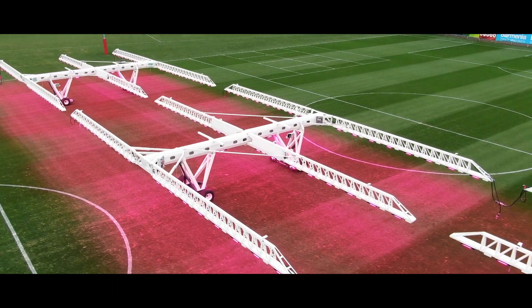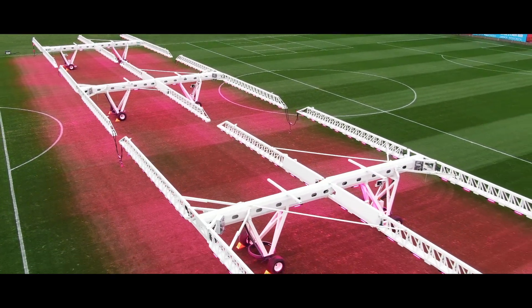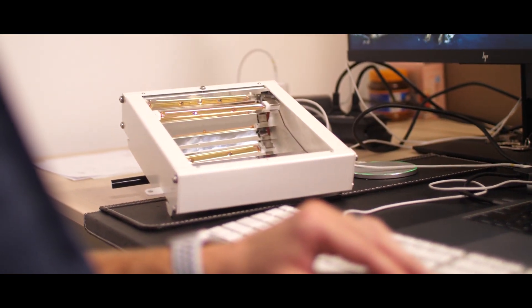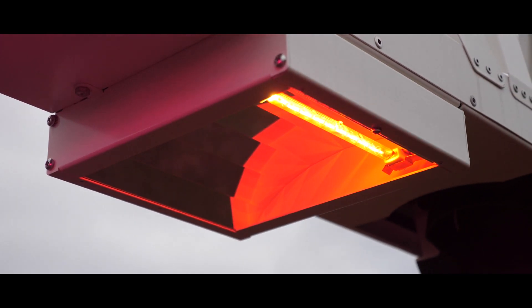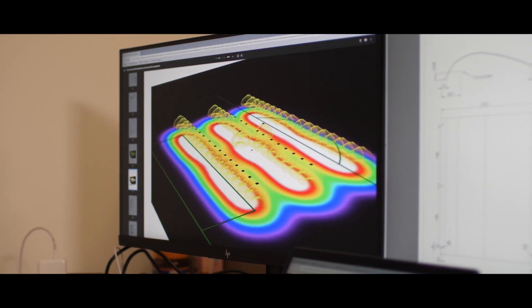Because the LED 440's footprint has six arms that are about five and a half meters apart, we had big gaps where we couldn't suspend infrared fixtures. We had to find a clever way to throw the heat out into those open areas in a very controlled way. We looked at a whole bunch of different techniques and nothing would answer the question, so we came up with an asymmetrical infrared reflector which pushes heat in one direction with a lot of control.